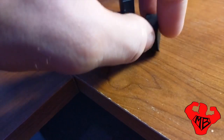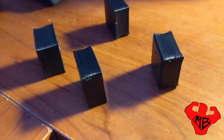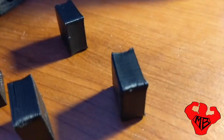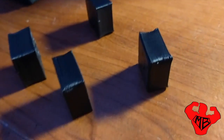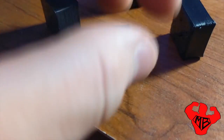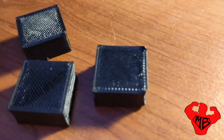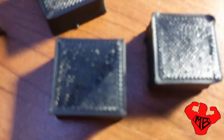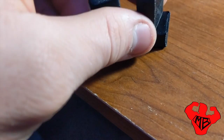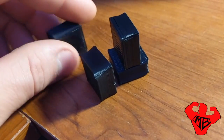You'll see some ringing and some shrinkage on these. A lot of people assume you can print ABS at like 225 or 230 and that's good enough, but it actually sometimes requires a lot more temperature than that. Here you'll see some really bad warping at 260, but on the other ones — this back one was 245. What's really important is the extrusion on the top. The hot one is going to have corner warping because the piece is shrinking as it's cooling, and you'll also see extrusion issues. It turns out 245 was probably the best temperature. So if you're going to print ESUN ABS+, you're definitely going to want to print at 245 or something warmer.